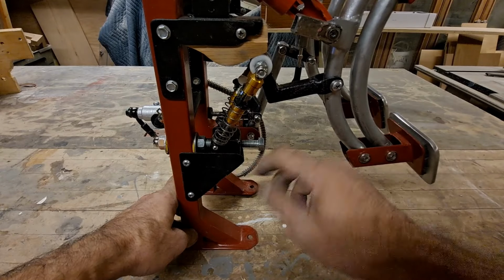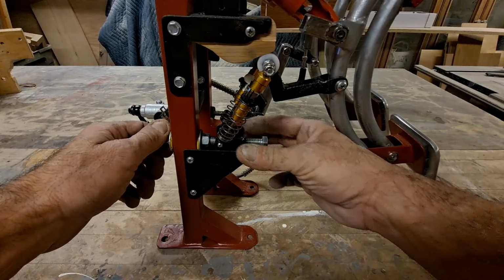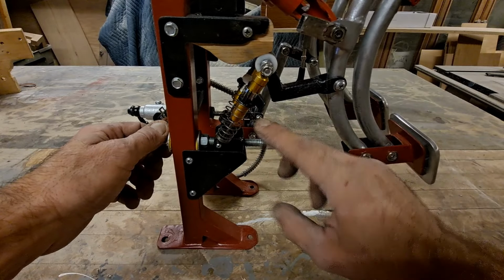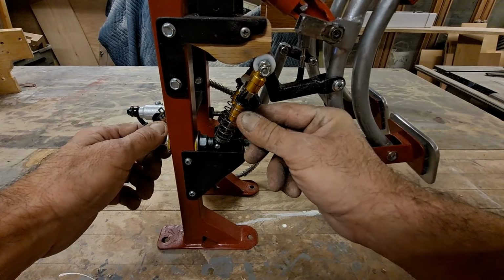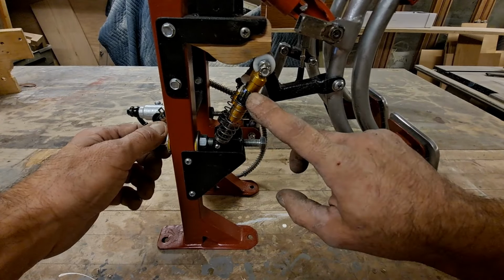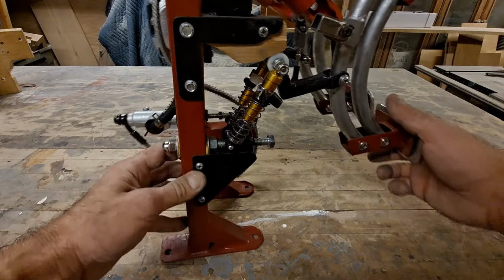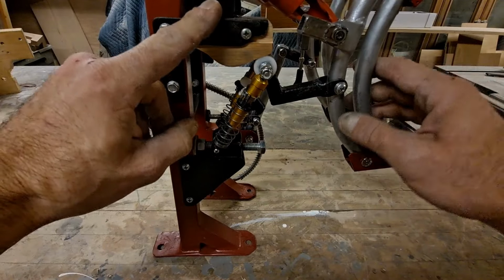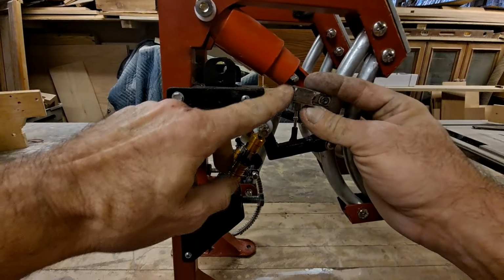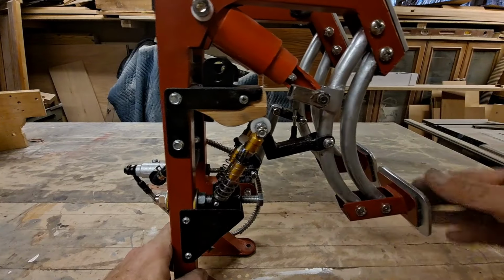Now, if you look down here too, this knob and this bolt back here allow this pivot to go back or forth, front or back, which actually does change this. And then I can obviously tighten these springs up too. All three of those, the block shaping, this pivot, and the spring tension, change the way I can make this thing feel. So, works out pretty good. The potentiometer is going to sit right here. I've got this arm right here that's going to basically drive it, and we're going to show you that in a second.